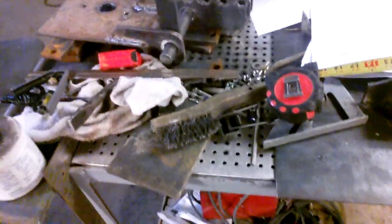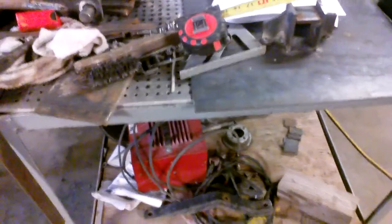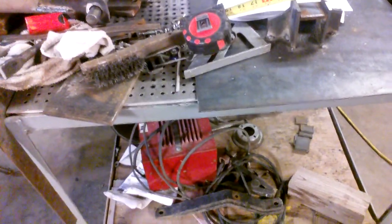I'm thinking these might work, and if they don't I ain't too worried about it, because I've got the lifting arms I made down here — that were on the back of that Ford LGT17H. I took all that off and saved it when I was building this one. I think they're 32 inches long or something like that. I made them real long because on that Ford, when you attach the three-point hitch stuff it was just way too close to the tires — my little disc was actually hitting the tire.